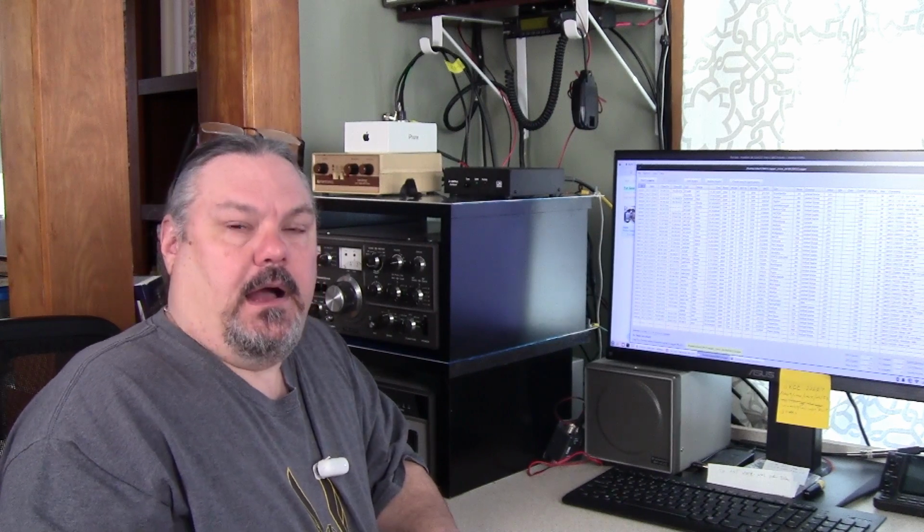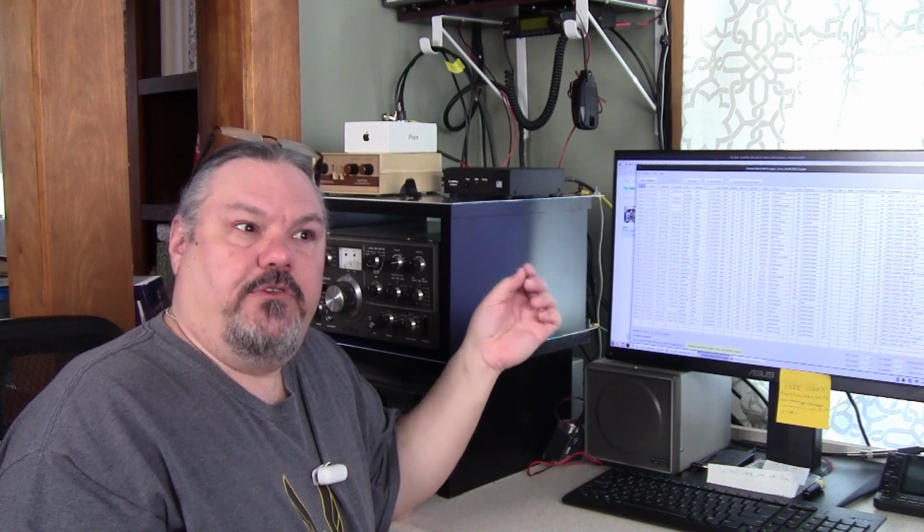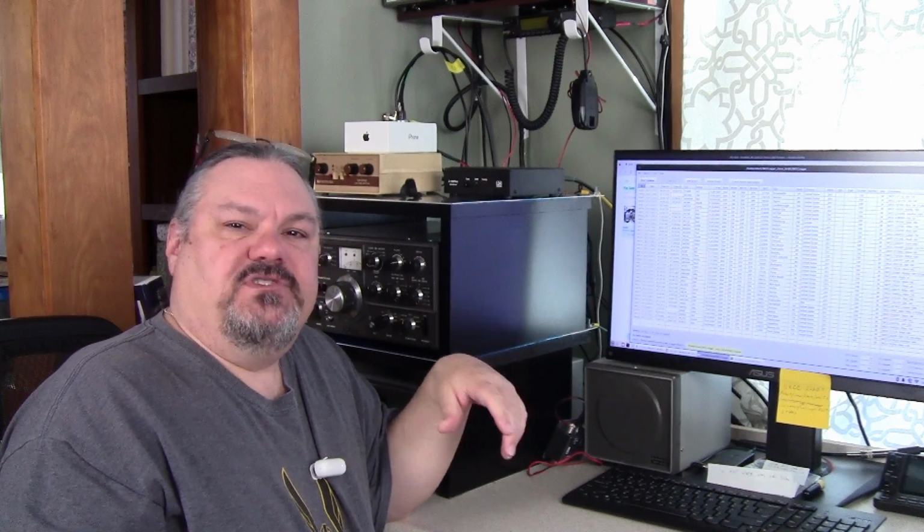However, I use Linux as my operating system, and the choices for software-defined radio software, or SDR software, Cubic SDR is one, there's a couple others, they don't provide the functions that I want. Specifically muting functions. When a receive loop antenna is in the same general vicinity as the transmitting antenna, there is always some bleed through that occurs. Even though I have a switch on the SDR, which disconnects the receive antenna whenever I'm transmitting on any of my other antennas, inevitably signals bleed through.